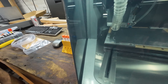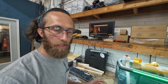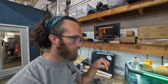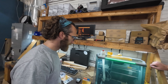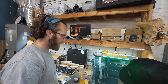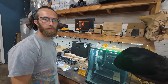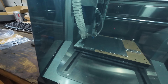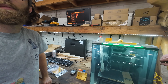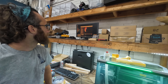After this finishes I'm going to evaluate everything. Since we haven't touched anything, I can go back and adjust the g-code each time — like go a little bit deeper on that side, which matters because of the chamfer bit. Why is it skipping every other one? Sometimes even with the laser or plasma it jumps around. I haven't looked into whether there's an order or strategy setting, or if I even set those uniform.